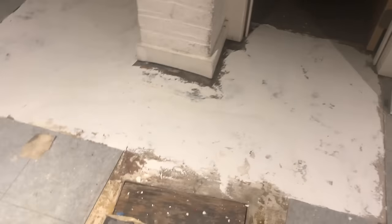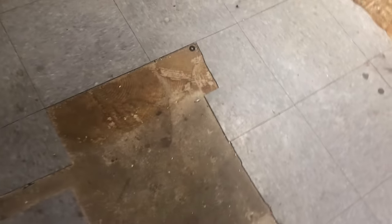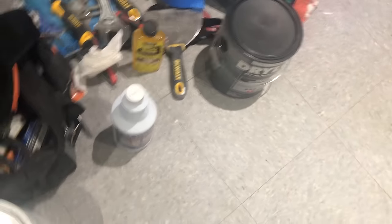That's pretty much it for this area. Now, back to the floor. Originally it looked like old tiles, but we needed to get down to the concrete layer. There was a lot of glue over the concrete, so I used a machine — right over here — combined with a regular drill with a chipping bit to loosen up the adhesive. I also tried Henry adhesive remover — it helped quite a bit, though not all the way. Removing the glue was step one, and then we cleaned it all up.